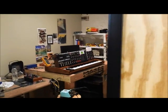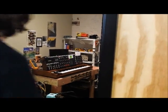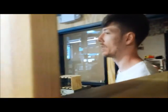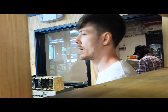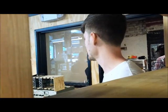On that board, you've got about 30 different calibration points. There are tiny little boxes with a little screw or knob type thing, and they need to be turned just a millimeter or two left or right after it's all assembled to make sure that it sounds perfect, it's in tune, and that all the waveforms are correct. There's a lot of love and care that goes into breathing life into the circuit board after it's assembled, and all that happens in this room. If anything has failed at this point, it'll get swapped out. Every key, knob, dial, fader, everything on it is going to get a full inspection before it gets shipped.